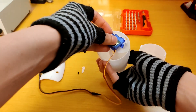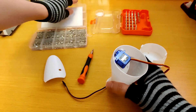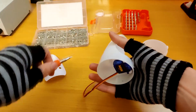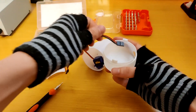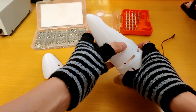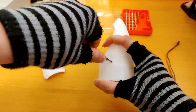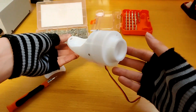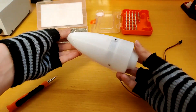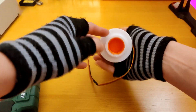For the mechanism, I'll use this microservo motor, which goes into place and is secured from each side with some screws. Then the servo cable is routed out through the bottom part, which is secured into place with some more screws to the nose cone itself. The hatch goes on and is locked into place with the servo horn. Then I glued a plastic bottle cap onto the bottom of the nose cone so it can attach to the top of the rocket, as it has threads.